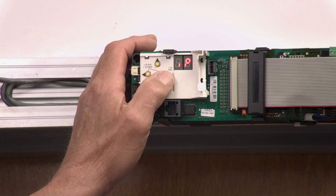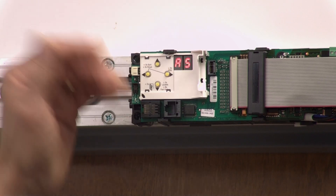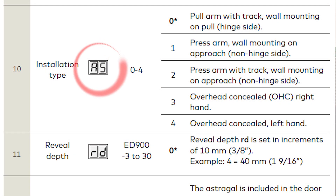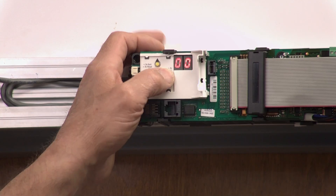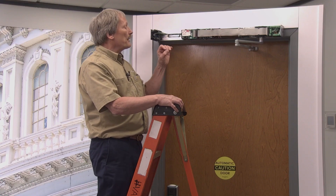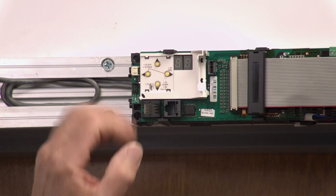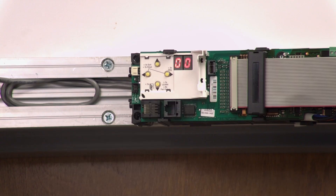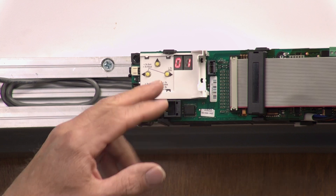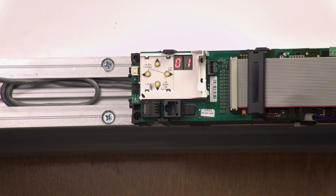To get into program mode, it's always the same: push and hold the right button for about three seconds, and the LED will come up in program mode. The first parameter is AS, and AS is push or pull. Push the right button again and that shows us the default value. 00 would be for a pull-side mount — that's the default. I want to change that to 01 for a push-side mount. Push the right button again and the LED flashes. Use the up and down buttons to change the value to 01, then push the right button again. It stops flashing and now that value is entered.